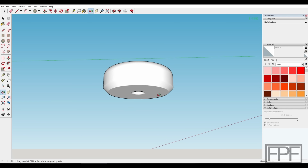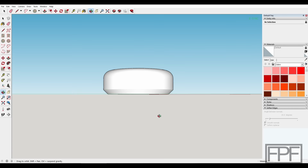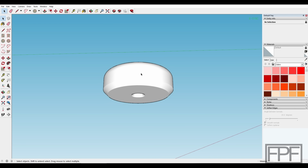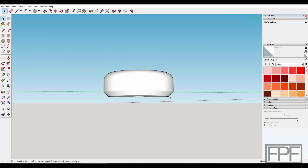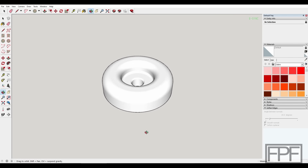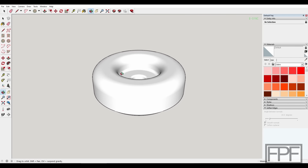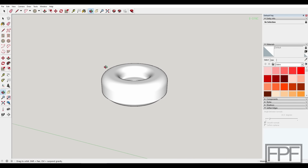The challenge there is TPU is so hard to support. Anytime you use supports with TPU, it is just a giant mess. So I figured, you know what, I'll just knock the diameter down enough, and with a nice fat bevel on here, we should clear. I took the measurement and then I took, I think, 0.5 millimeter off to try and just buy a little extra space so we're not printing 17 of these to get just the right fit. So, all right, I'm going to print this out at probably about 70% infill and see how it goes.